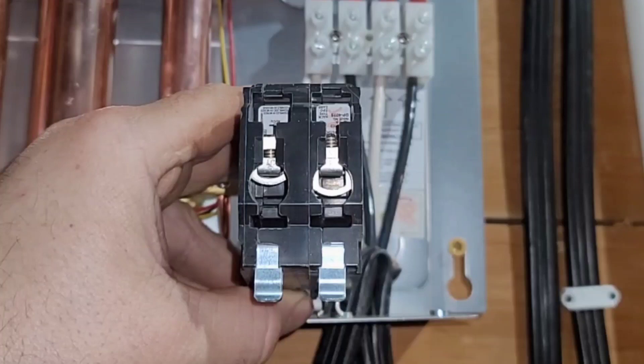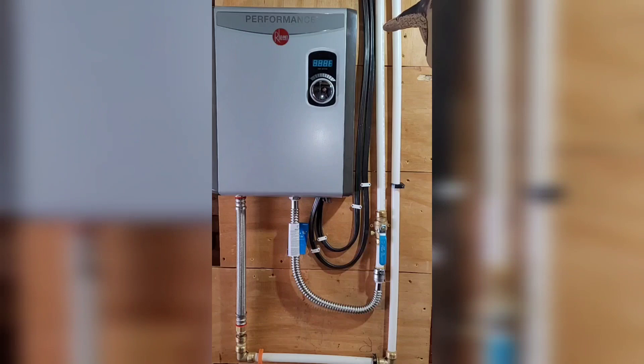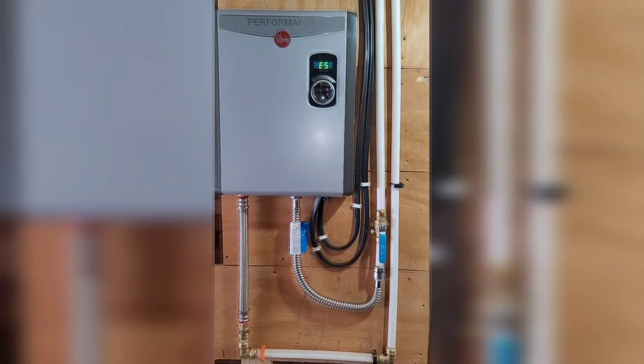Here's the final setup — I couldn't get it to fit in landscape so I put it in portrait. You can see the inlet line that feeds the water tank and I have a shutoff here just for service. The water comes in, goes through those two heating elements, comes down and out to the house. You can also see the electrical lines coming in. Overall I'm pleased with how the install went. If I'd started with the original coil, the cold would have come in one side and the hot gone out the other — that would have looked nicer — but it works exactly how it should.